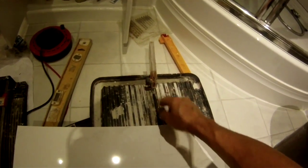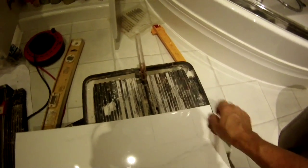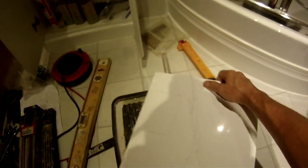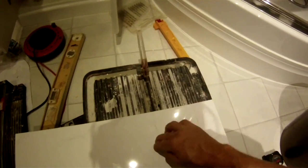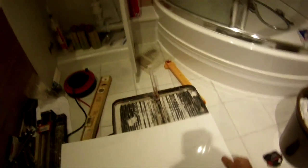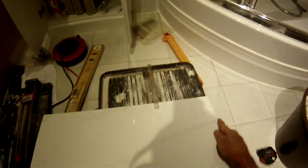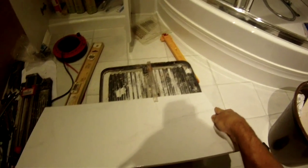It's better to drill through from the shiny side of the tile, because you'll get a bit of the tile surface chipped off if you drill from the back. There are probably many different ways of cutting the hole — one would be the circular diamond hole cutter. The next cut is particularly difficult: cutting a rectangular section out of a tile. The straight cuts are easy with the diamond blade, but cutting across it is tricky because you can't get the piece over the guard, so you'll have to try cutting in diagonally.